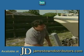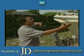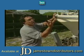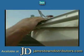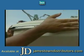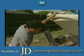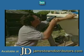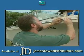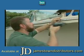Now we're at our critical bend. On any kind of point bends where we're going to be twisting the rail around and possibly losing some of the form that holds our insert, take a small piece of insert and install it at the center point of the bend, then work your rail around. We'll come back and pull that out, but it's holding the nice shape of everything. This is going to be real important if you get into hard corners at transoms or a sharp pointy bow. When you're butting your aluminum rub rails together, it's nice and easy — you don't have to do any overlapping, you'll just go right up next to each other.